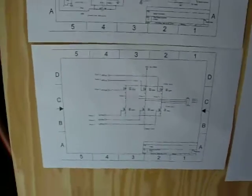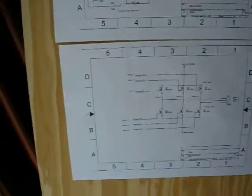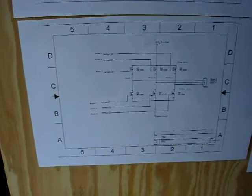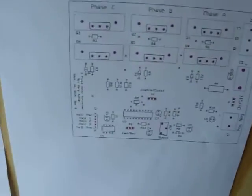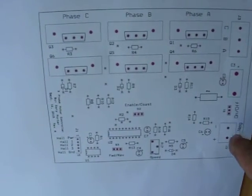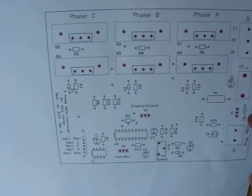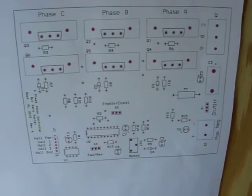Down here we've got the six FETs — the top FETs and the bottom FETs. This entire design is right off of the MC33033 datasheet. Over here I've got the PC board layout. The main power comes in here and the ground splits. There's a portion of the ground plane that comes over to this area with an air space, and then the ground plane here comes back. So all the heavy current is flowing this way and the light current is flowing this way.